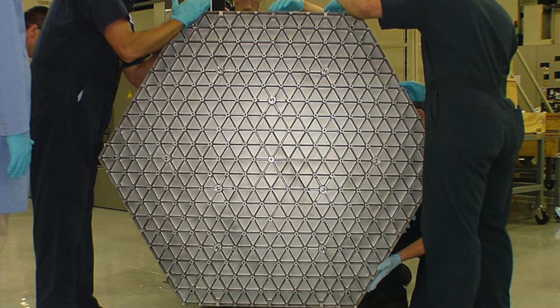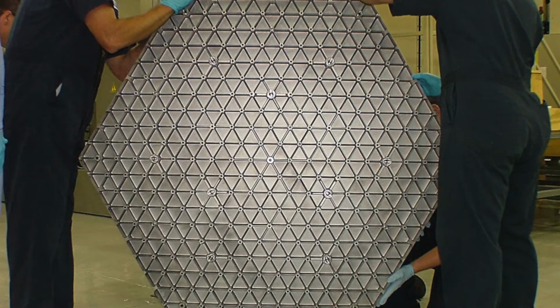This is why beryllium is mainly used in a lot of aerospace applications, because although there are other materials that are really good with temperature fluctuations and thermal expansion, most of those are very heavy, dense metals, and that makes them really hard to put up into space. Because of this, beryllium is used in applications like the main body of the mirrors of the James Webb Space Telescope. Now, these mirrors aren't just solid beryllium, they're actually formed with a really cool process where a fine beryllium powder is used and basically compressed down to give the mirrors their shape. What this does is it makes the mirrors even less dense because you're not using a solid amount of beryllium, and even lighter to be able to launch into space.